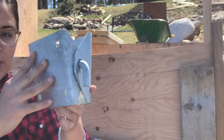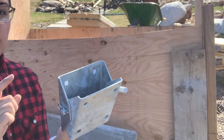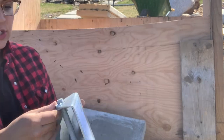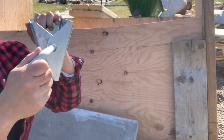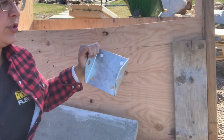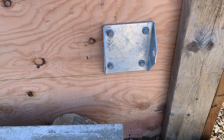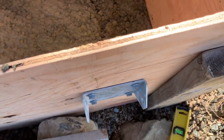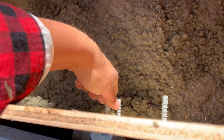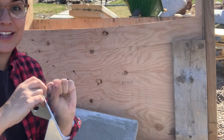Now we're going to attach these guys — I don't know what they're called but they are built specifically for attaching docks that pivot on them when the waves move. We just take this little pin out and remove this piece. One piece will go onto our dock and the other piece is going to go directly onto our concrete form, and we're going to do that with galvanized bolts. That way these will be secured into the cement and grab on — we don't have to drill afterwards. It secures itself while it dries.